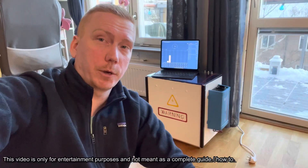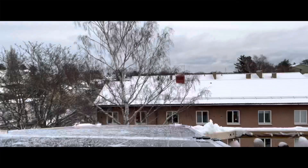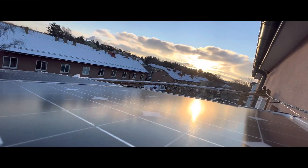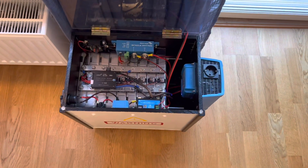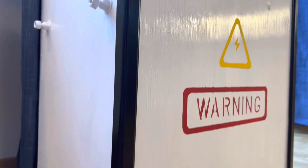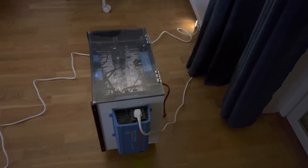In this video I'm going to show you how I built this power wall, a quick overview of all the parts inside it, and my tiny solar panel array out here on the balcony. My solar panel array is at 150 watts and during summer it provides about 125 watts peak. Right now in December it's putting out 25 watts peak, so during this time of year solar is almost useless. This is my DIY power wall with 3.3 kilowatt hours of battery capacity — that is enough to power my TV, some small lights, charge some phones and the iPad for about 24 hours straight. It is completely freestanding and not connected to the grid, and it has both a 12 volt and 230 volt outlet.